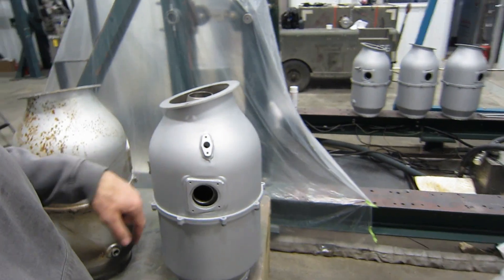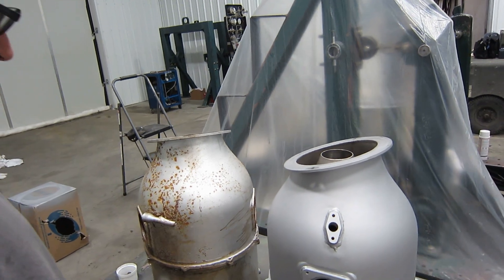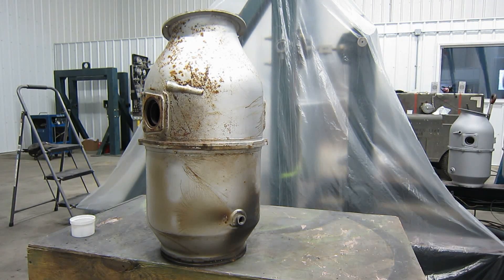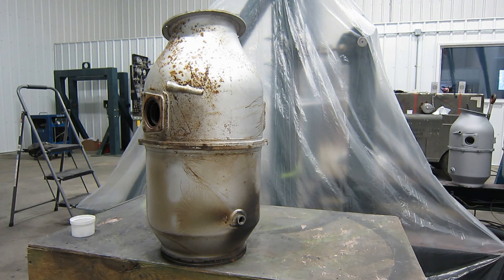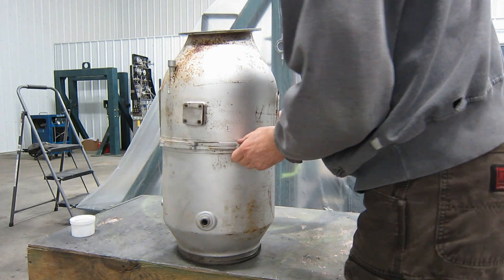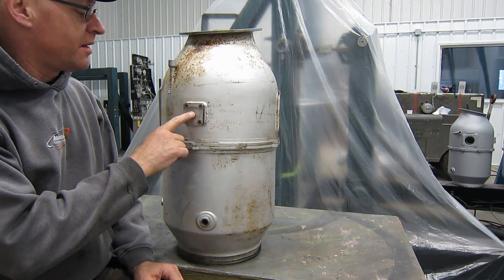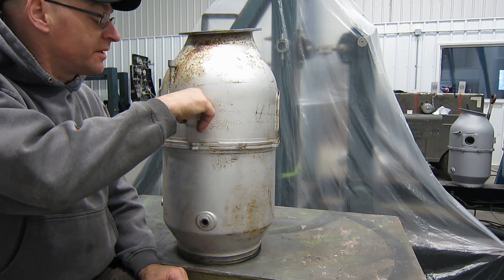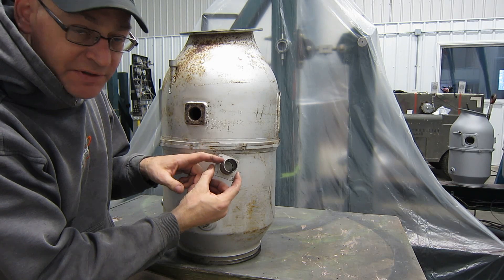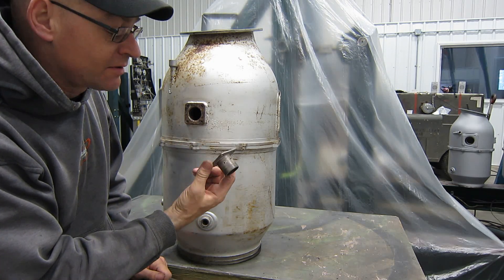We've got number five and number three. I've taken out the hardware to speed up the process, but we're going to lift off the forward half. We're going to look at the liner and inside, and I'll show you what we're going to be inspecting for to make sure it's okay. The first thing we've got to do - and it's already been done - is remove these bolts that hold the two halves together. There's also a combustor locator pin, but you'll see why I'm not calling it a pin in this engine because it's a bit bigger than a pin. This one has been removed previously and cleaned up, but it was just full of carbon and soot.